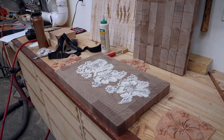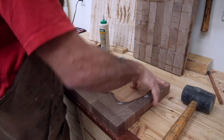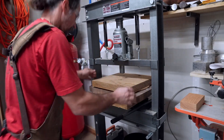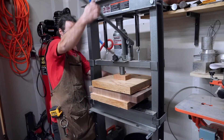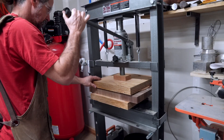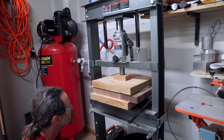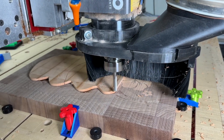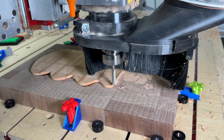One of the things I started doing off-camera was to blow it out with the air compressor and just get a fine layer of glue in it. Everyone who seems to be pretty serious about doing inlays uses some sort of press. I got this cheap Harbor Freight press quite a while back for doing straight-in flat inlays, and it really helped a lot. I think what happens is the fibers kind of get compressed a little bit and your inlays just look a little bit tighter. The end-grain cutting boards tend to absorb a lot of the moisture in the glue while it's drying, and this makes them cup upwards, convex-like.